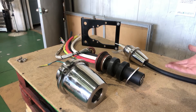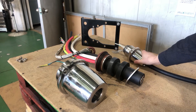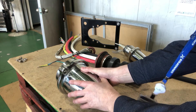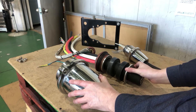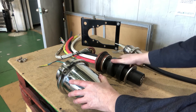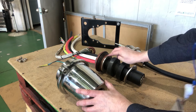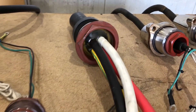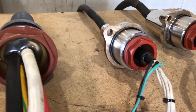This is the standard cable inlet, with the smallest version here and the biggest version here. It consists of a stainless steel housing, a lower truss washer, two rubber bushings, an upper truss washer, and a cable clamp.